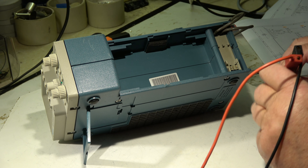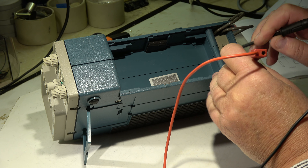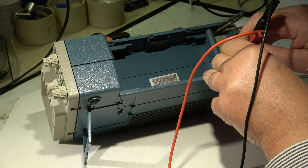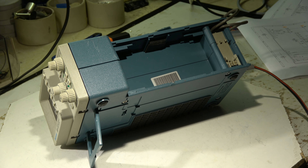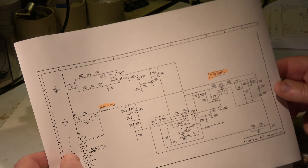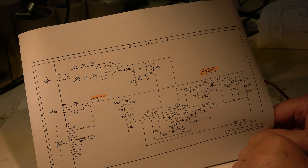First step is to measure the 10V here on these three-pin plugs. The center pin is minus and the outer two are plus, connected together. I measure here on the voltmeter and can see exactly 10-point-something volts — it's not depending on switching the scope on and off, it's always 10V. So the charging circuit — the battery charger — seems to be okay. The rectifier and switching power supply going back to the battery circuit all seem fine; there is no need to look there.